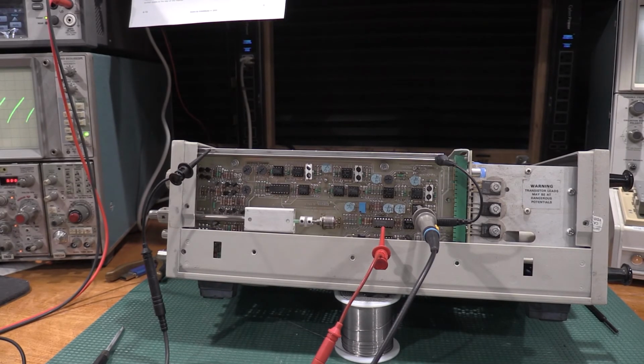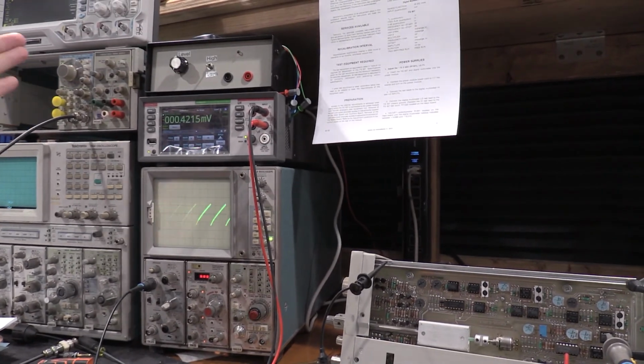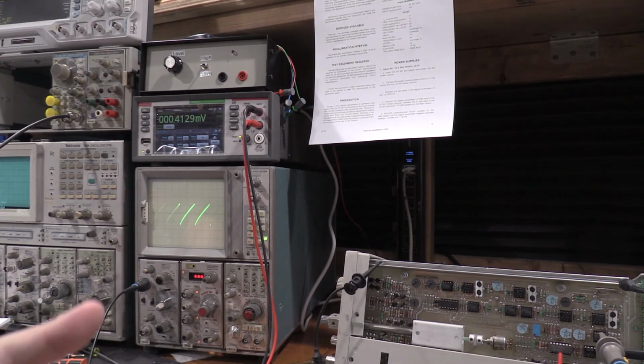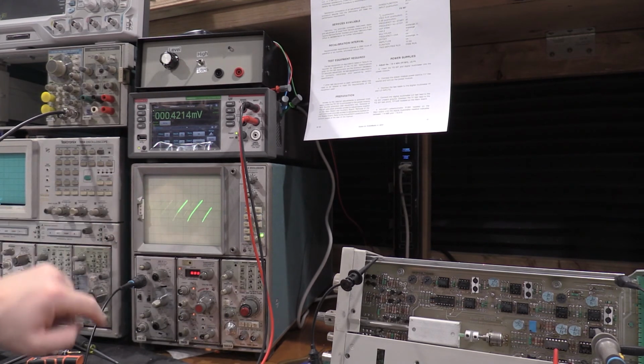Okay, I finally figured out what I was missing on step 20, because this didn't make sense. So what you do is you don't feed the function generator into the IC. It didn't make sense feeding the function generator into an output, because pin 6 on that particular op amp is an output, so that didn't make sense at all. So the function generator sets up the scope for measurement. You get everything centered on the scope, everything like that.